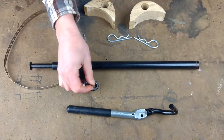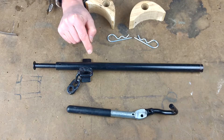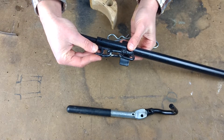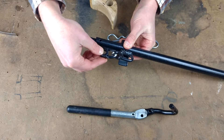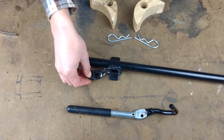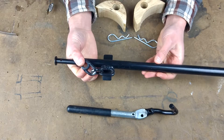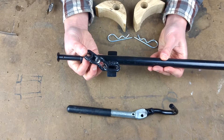The next component is the slide itself. This is basically just a piece of half-inch black pipe — I had this laying around for another project and it seemed to work pretty good for this one. A couple of modifications I made: I welded on this length of chain — basically three lengths of chain — and that allowed the slide when it retracted to have something to pull on the handle with, so it would get solid in that direction. Yet when you're extending the ram to split the wood there's a lot of degrees of freedom that the slide doesn't interfere with. On the bottom side of the slide I added a little anti-rotation device — I was afraid the slide would tend to get hung up, rotate down, and the chain would bind up underneath or on top of the ram. So that just keeps everything lined up, floating right above the cylinder with everything nice and aligned.